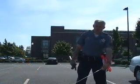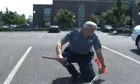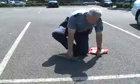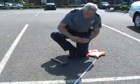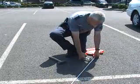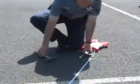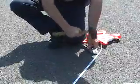Once you get your tape measure pulled out, make sure it's nice and taut and nice and straight. Lay it down, and then you're going to take a second PK nail, put it into your vice grips for safety reasons, and put it right at the 50-foot mark. And we're going to lay that into the pavement.